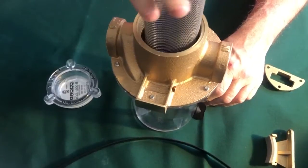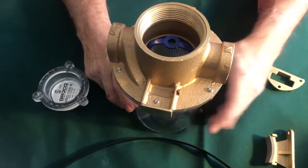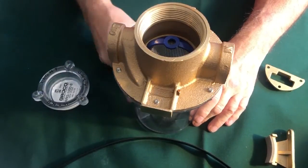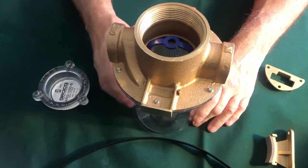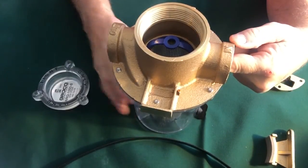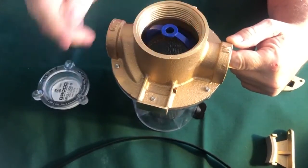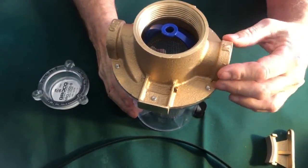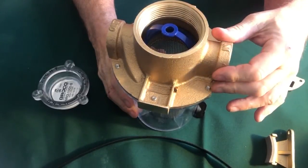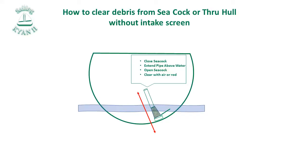When we put a strainer on like this, we leave our water inlet an open hole — we don't put a strainer on the outside of the hull. The reason is that if the outside of the hull gets plugged up, you have to dive below or send a diver down to unclog it. If you have instead an open through-hull where water comes in and you're catching it in the strainer basket, it's much easier. If something gets clogged, you can simply close the seacock off, undo this filter basket, and extend your pipe if it's above the waterline. These filters are meant to be either above or below the waterline. Preferably below the waterline can give you more pressure. You could run a direct tube down and clear out the blockage in the seacock.